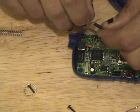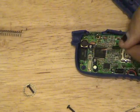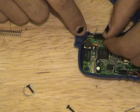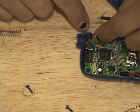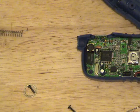I haven't pre-tinned it yet. Now the soldering is kind of small, so I'm going to do that off frame, but there's a very small point on the board where we pulled the original antenna off that this is going to go through hole, and there's a small little tab. Let me get one of my multimeter probes and zoom in real quick.